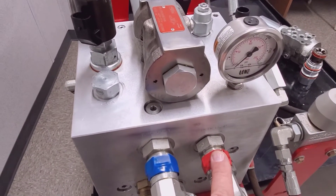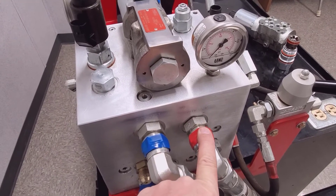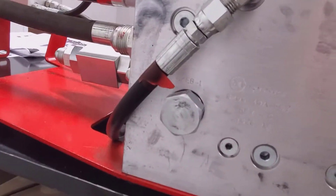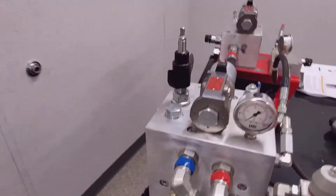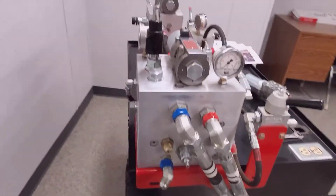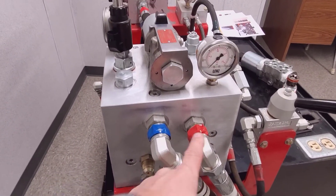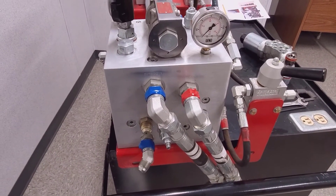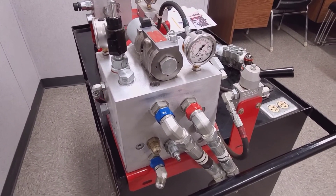The solution comes from the pressure side of the opener circuit. Once our wings are out, we engage our opener circuit. The pressure side here opens up CKEB1 on one side and CKEB2 on the other — two pilot-operated check valves that create a path for the wing lift oil over to the opener side for pressure and return. It's a very effective way to do so, ensuring we can travel across the ground without bending those wing lift cylinders.